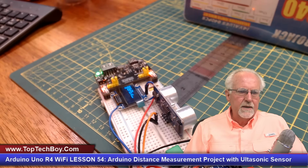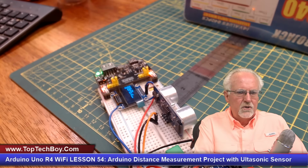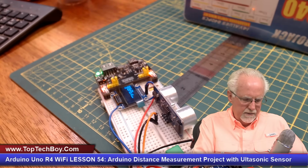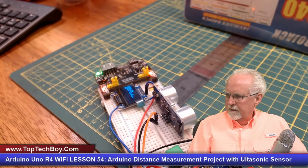And so let's look at our prompt. So up here, we say, set the cursor, we do this, we do this, we do this, we do this, and then we display it. Well, after we display it, then we come down here and we display on top of it. So here, what I think I need to do is an OLED dot clear display. That's probably where that needed to go. So let's try that.